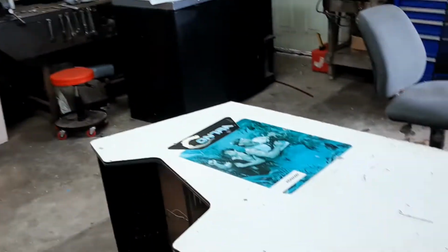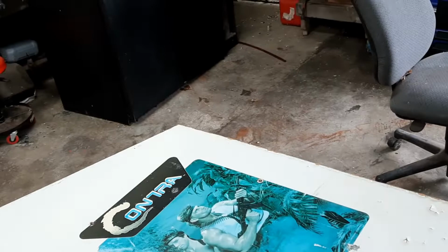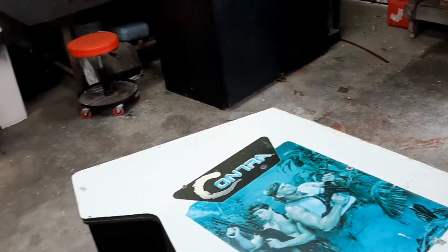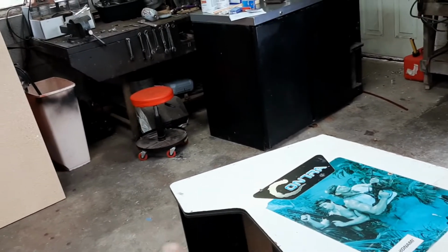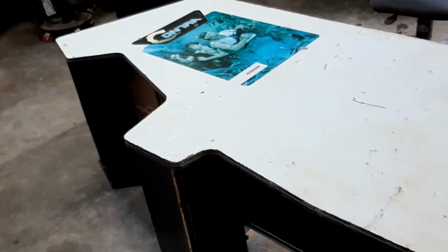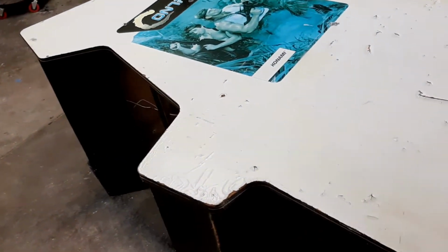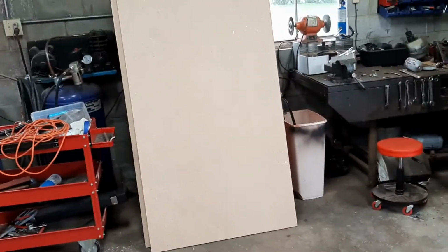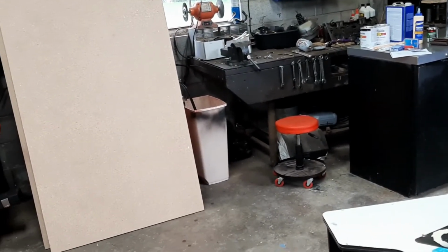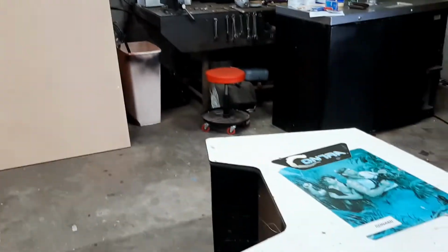on this cabinet, square up the bottom and the back, and then I'm going to use a cutoff bit on a router to trace this top and front profile. I'll probably use the sheet that I cut out to make the second profile with, so the second profile matches whatever I come up with on the first one.